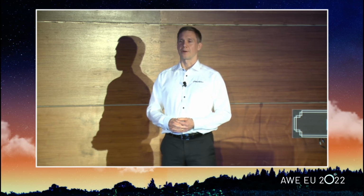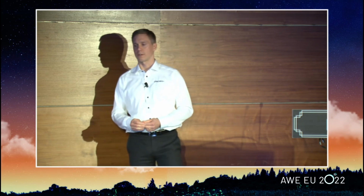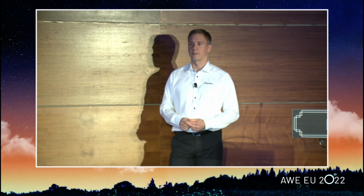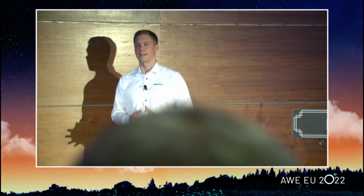And what is the efficiency between the incident power and power redirected in light? Yeah, so we like to talk about it in nits per lumen. If you get X number of lumens from your projector, so let's say 1 lumen, a very small projector, you have very little output, 1 lumen. So how many nits to the user's eye do you get? In this case, you are moving somewhere in the 300 to 800 range.